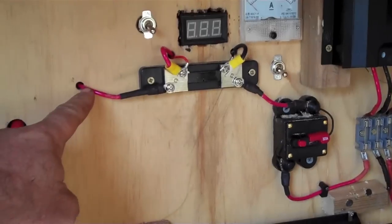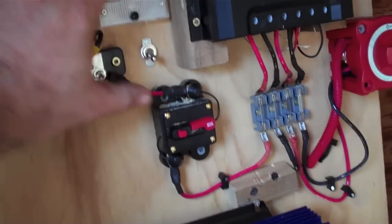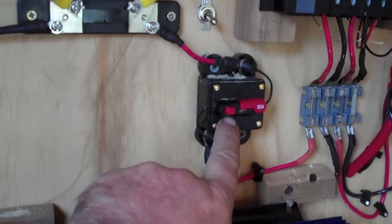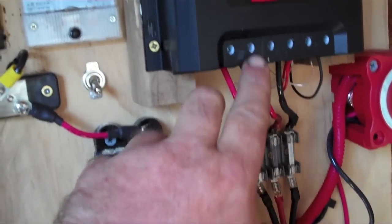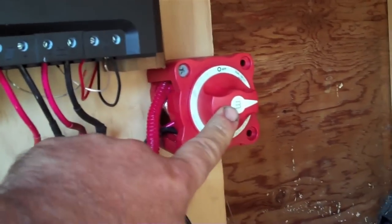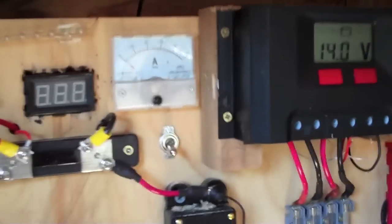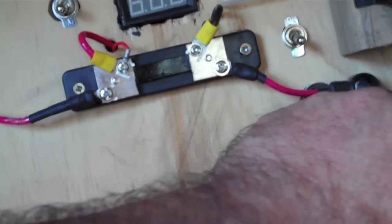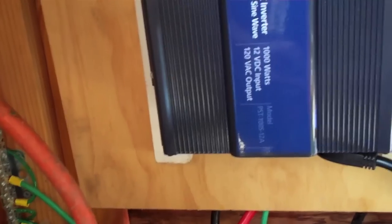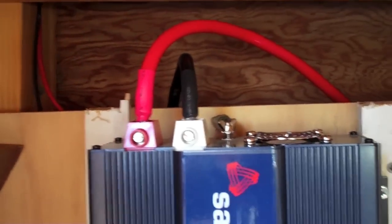The wires come in here — here's my positive going through, and this will tell me what I'm pulling. My system's full right now so it's not actively monitoring, but then I have a breaker here and fuses here. That's my positive, that's my negative, and these go out to my batteries with an off-and-on switch. The wires come in from the solar panels, through here, and into this controller. I also have this pure sine inverter — a thousand watt pure sine — which costs more than a regular inverter, and I have that fused up too.